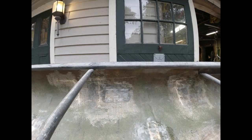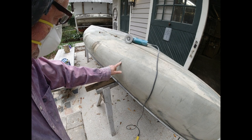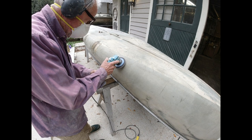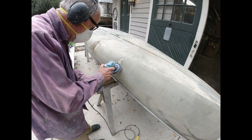I'm trying to do a good job here. I know it's not a work of art, but I want it to be usable for the kids. The patches on the inside are cured — let's see what I can do about taking some material off the outside. This boat is so thin. I made the inside patches with two layers of glass — one semi-rigid woven and then the six-ounce woven.